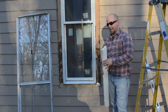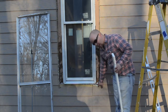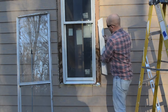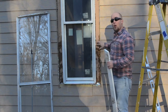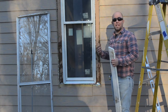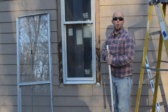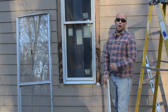Welcome back — as you can see, we got the window in. Here's the old window that we cut out. What we did was run foil around all the edges and wrap them. I put some one-by-four in as a backer. Next we'll put the hardiboard trim back on, which will cover all of this up. The backer helps level the trim past the hardiboard and gives us something to spray foam into. We've foamed it and caulked it on the inside, so now we have a really weather-tight, energy-efficient window installed. This is a Pella window — a fully wood, aluminum-clad window — great windows.